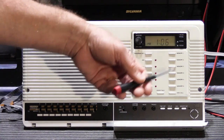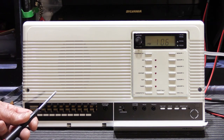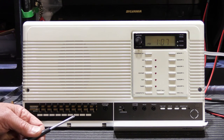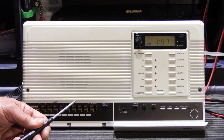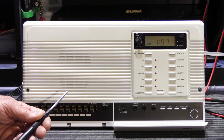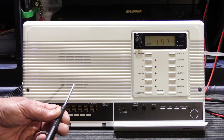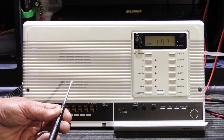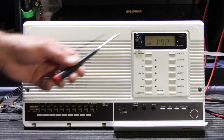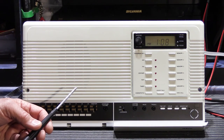After I did the fundamental repairs on this — because when it came in it was for the most part non-operational — the normal course of repair here at my shop on a unit like this is I disassemble it completely so I have the three boards out of the face plate. I did the necessary repairs to make it function again, then I put the boards together outside the face plate to test them. Once those problems were identified and repaired and we got it to the point where it seemed fully functional, we did all of the normal refurbishment work that we do on every 3303. After all of that work had been done I pieced the three boards back together again — this is what I call the out-of-the-face-plate testing.